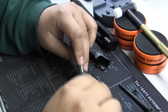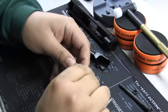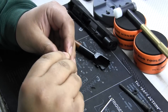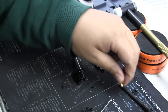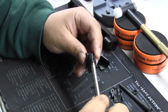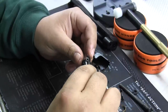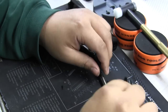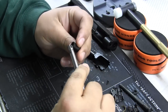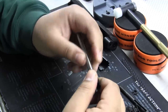You have this little brass part right here. Let's get the brass part off — there we go, brass indicator, and then here's the second half. You can take this apart. The cool thing is this is pretty much self-contained, so in my honest opinion don't mess around with this — just leave it as is. This is how you replace inner barrels and buckings. I'll probably change my bucking later; you just need to put it in the screw and put it back together.